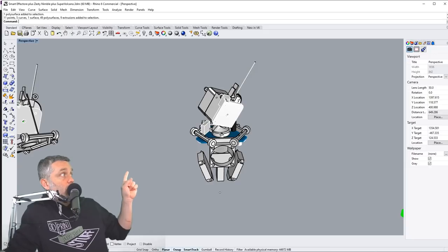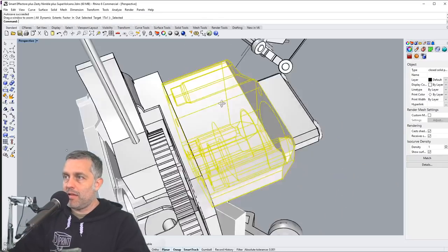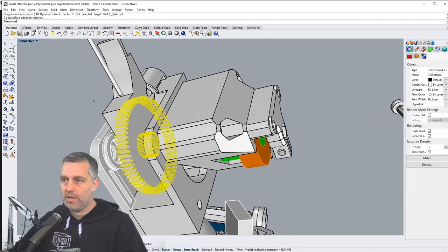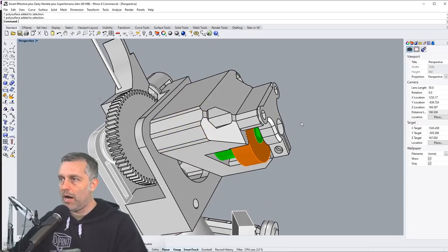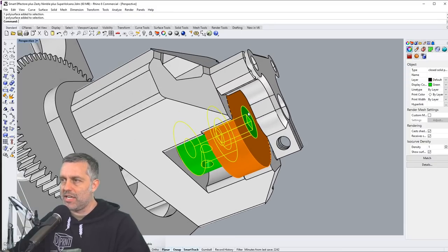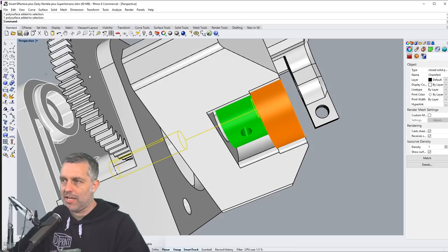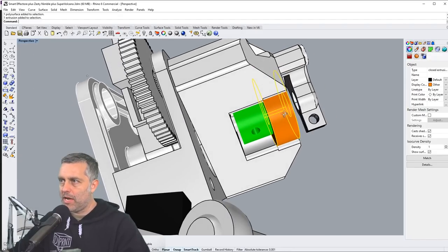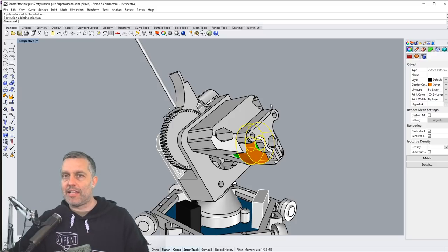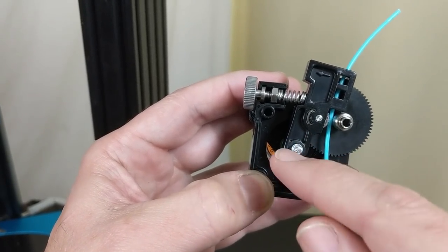This geometry in the background is what I've come up with. Looking closer: there's a main body portion that mounts to the E3D Titan extruder assembly — the 3:1 gear reduction box — a clamp that mounts to the cable housing, an axle connector that connects the square drive on the end of the cable to the axle shaft, and the axle shaft is what will engage the Titan. Then there's a skateboard bearing at the end of that. Let's take a look at this after it's printed up.